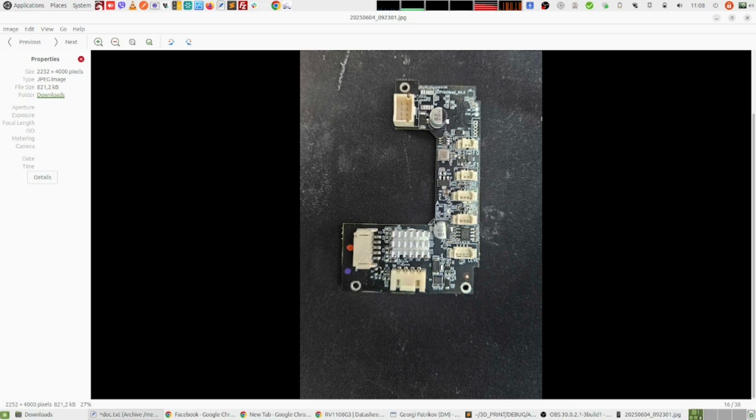And that's a fairly long cable from here to the motherboard, and it's moving. And the main thing I think is the issue here is that here on this square hole fits the extruder motor, the stepper motor of the extruder. And basically, when these motors are running, they're generating a lot of electromagnetic noises around them. And this connector is right on top of the extruder motor.